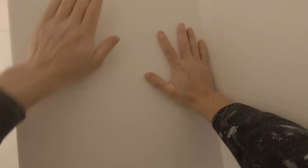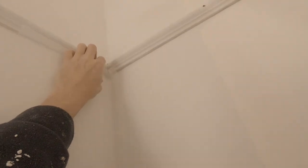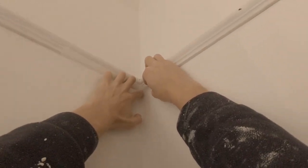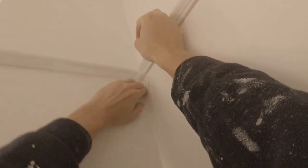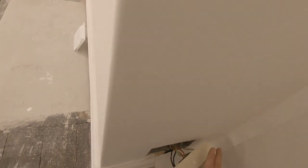I'm going to go up to the top and do the same, just trying to move that back over a little bit. Again we've got a little crease creeping up here so I'm going to cut through it as close into the corner as we can. I'm going to lift those two pieces out and push that one through, allowing that cut to help us around that corner. Now I'm going to get these pieces trimmed up and get the socket back on the wall - and that is just how you come into a corner and around the socket area.